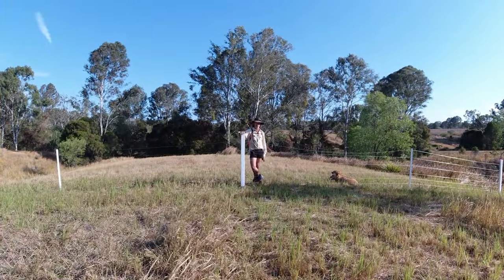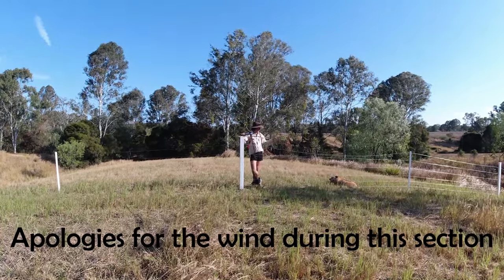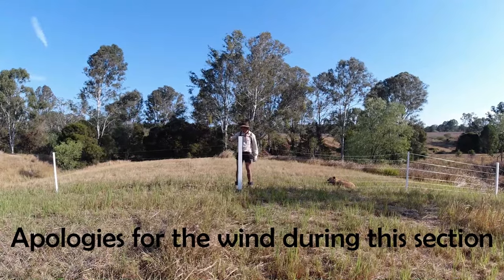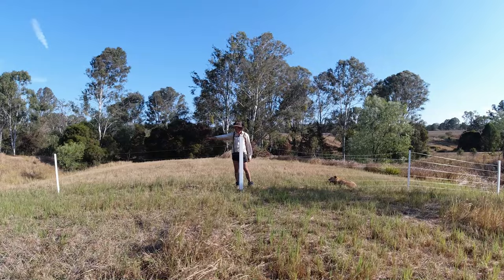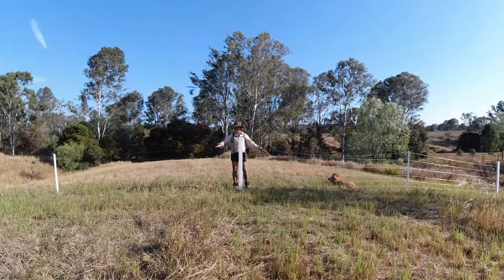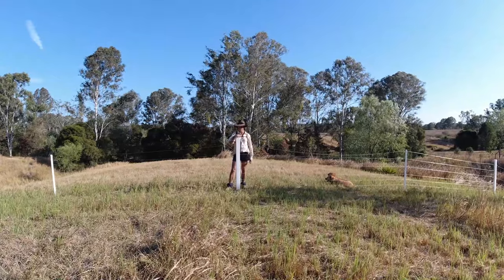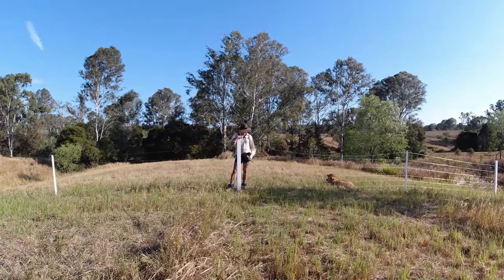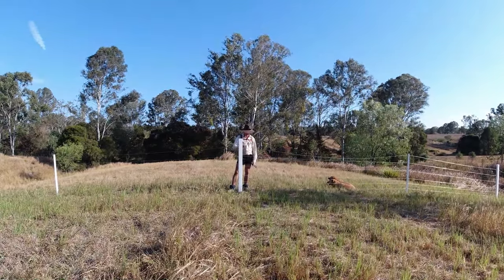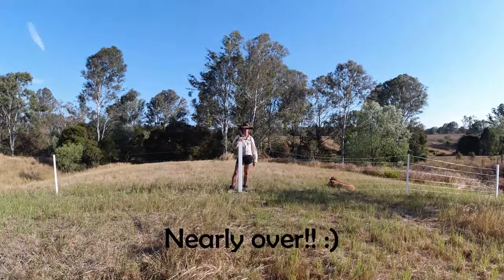I'll start by talking about the positioning of these H-posts - or strainer posts. This is on a crest of a hill. It drops down into a gully there, then crests up into this at the top of the hill, and you'll notice it slopes down into that other gully. If I was to put a normal T-post here when I'm straining this wire, as you can see the wire's facing down - as you strain it, the wire's wanting to push that T-post down. That's why you need an H-post at the top of a hill. This one is 30 inches into the ground and it's also got an 80-pound bag, or 35 kilos worth of concrete, halfway filling that 30-inch hole.